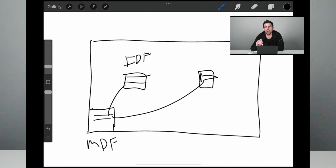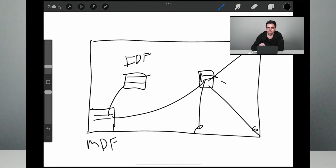As we're talking about the design, we're taking into account the floor plan. We're thinking about the placement of these switches, and the reason is really: where do I need Ethernet drops in my warehouse, and where will they come from? Ideally, we want to be within the CAT6 distance limitation for all those drops. This is a top-down view. If we had an elevation view with a warehouse and our IDF up in the ceiling, we would want to calculate the span to go over and the span to go down.